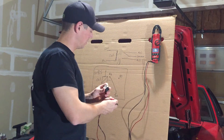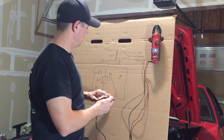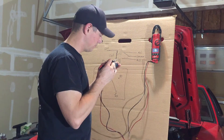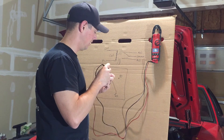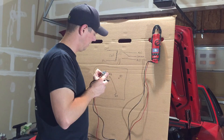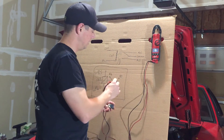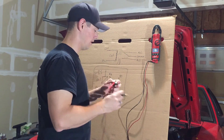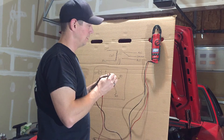The other thing we're going to check is our normally open or normally closed contacts. In a normal state with no power applied to the relay, pins 30 and 87A are tied or touching each other. I've got 30 down here and 87A in the middle, so I'm going to touch those — continuity. Now when the coil is energized, the contact switches over to 87. So right now between 30 and 87 we have nothing — OL, it's not touching at all. Going back to 87A gives us continuity.